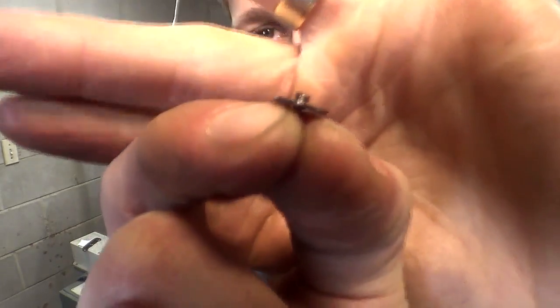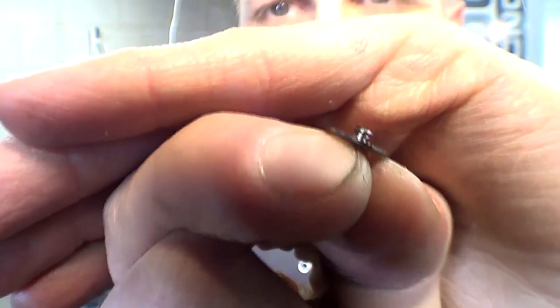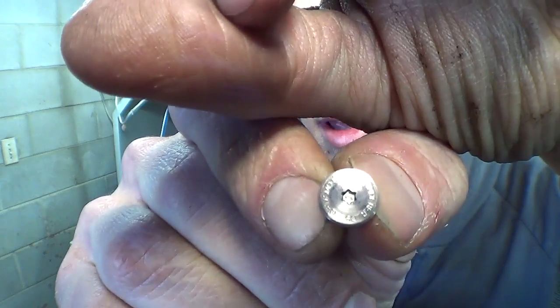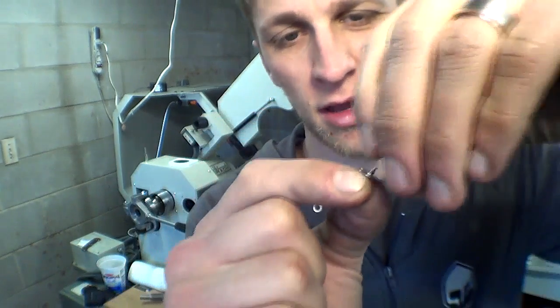So here's a close-up of the threads. This is a 440 thread. Very short, very close to the shoulder. It's hard to do. Super thin, titanium. This thing is tiny. And then in the top part, in a secondary operation on the mill, it'll get engraved and T9 Torx put into the top. So that's secondary. And you can see this is left with a little nubby on the top. This is so that I can grab it and screw it into the next fixture. Anyway, to make these, let's start her up.